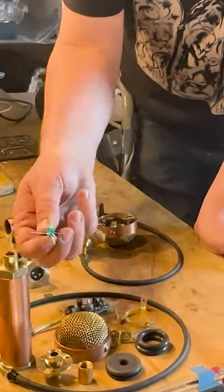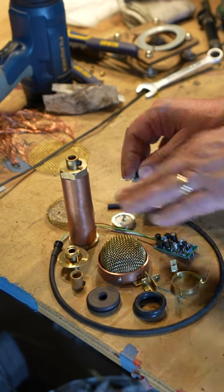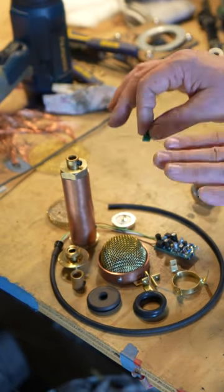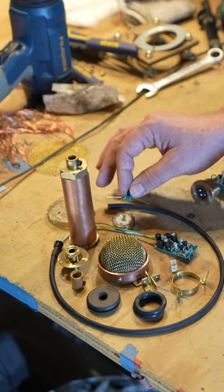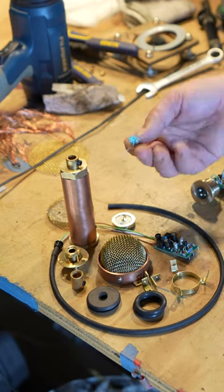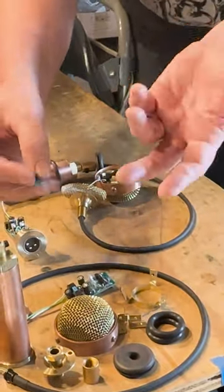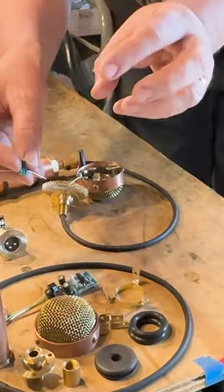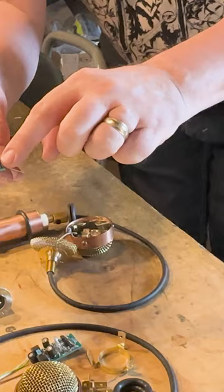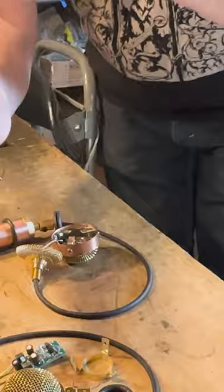This is really kind of the heart of the circuit. There's a JFET there, which does the real work of converting what the capsule hears — that little electrical signal generated by the capsule — into a workable signal that the whole rest of the chain can hear and work with. Those are all individually biased, which means we plug it into a special test jig, look at it on an oscilloscope, look at the distortion characteristics it has, and dial in the exact right values of these resistors that pair with it to set its operating point.